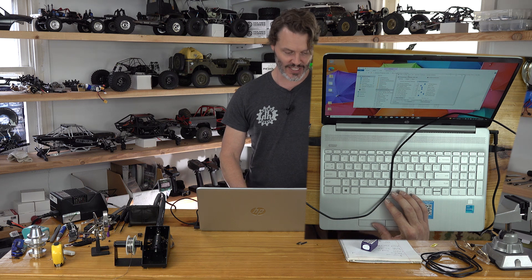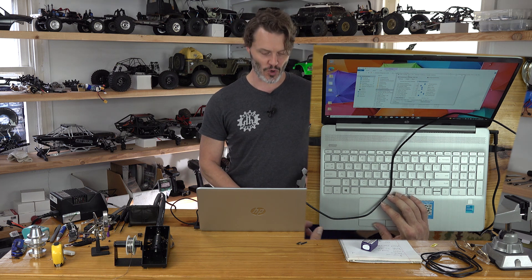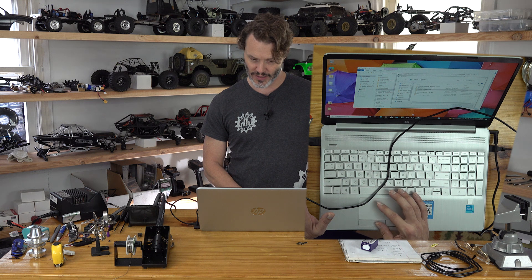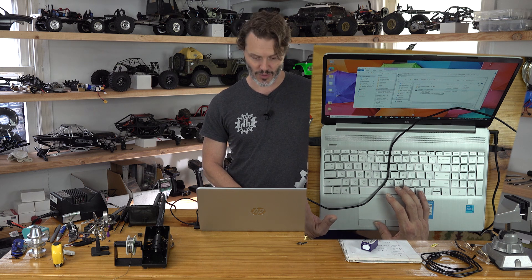What I need to do on this one is update it, because this one has the old firmware with the temperature rollback set a little bit too low. We have this binary file listed on the website — you can go to the product page and download the binary itself. We go to the Flash tab of our programmer and click Load Firmware. I know it's one folder up. The file is called 'Crawlmaster Mini at 175 Fahrenheit fixed.' On your side it will show as the 1.1 firmware for the Crawlmaster Mini. Double-select that, then hit Flash Firmware. This takes a little bit of time.